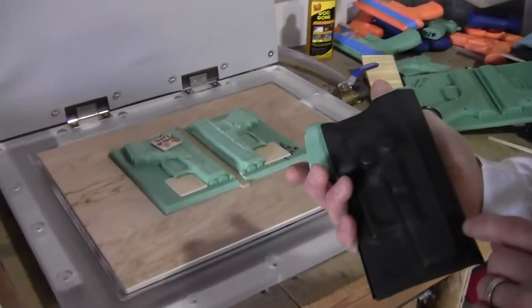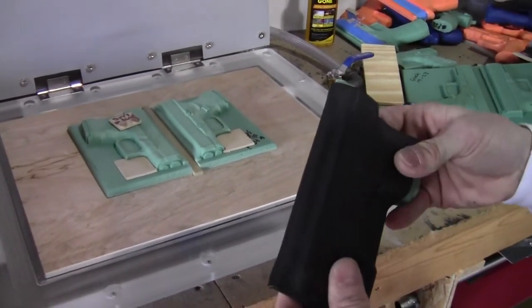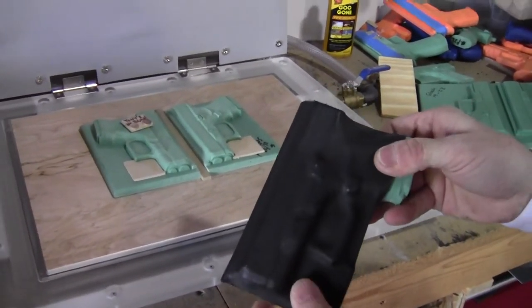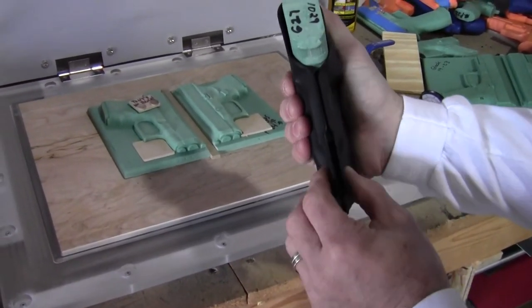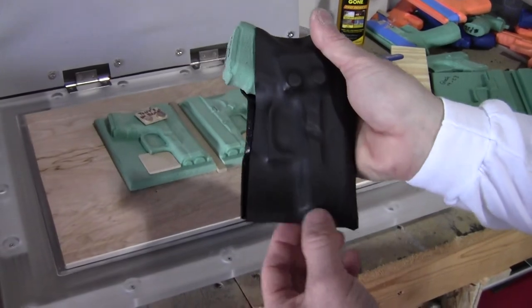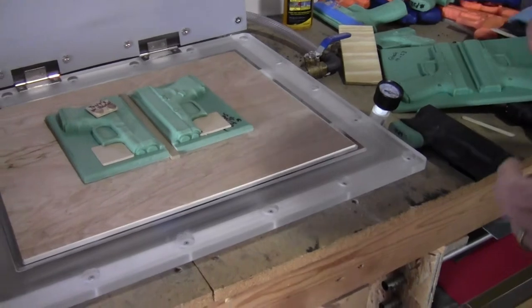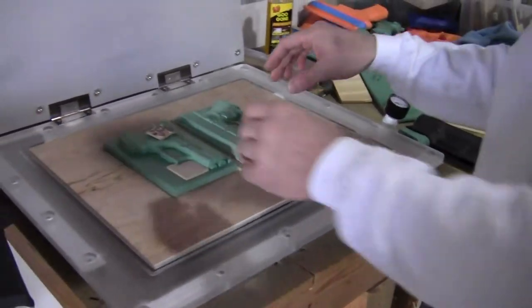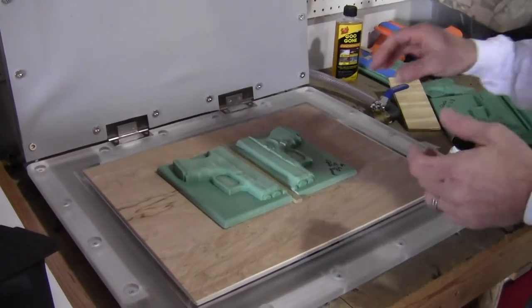Essentially what I do is take a mold gun, wrap it right around the mold, put it in the middle of a strip heater, heat it up, and form it right around the mold. You can see right where I have the quarter-inch material blocked out that eighth of an inch, and then of course you cut it, make it work for you, and you've got an inside-the-waistband holster.